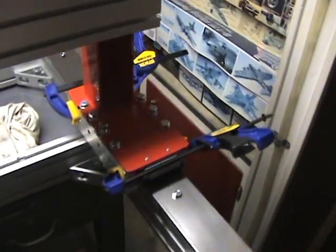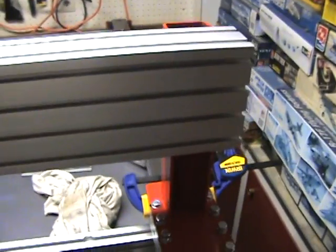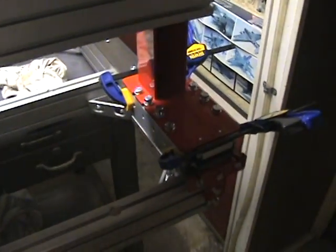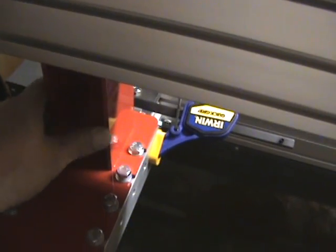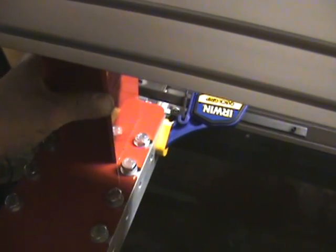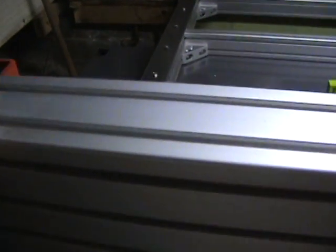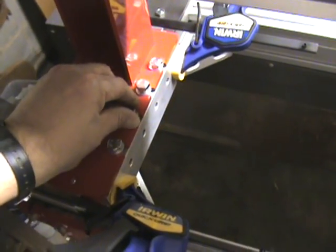The other side I still have yet to finish tightening. I wanted to get the squareness of the gantry aligned, so I pulled everything forward. This side was nesting up against the stops, but this side was retracted a little bit, which meant the gantry risers are actually a little crooked after being tightened in the back. So to alleviate that, I undid all the bolts on the riser to the extended carriages so that they were all loose.